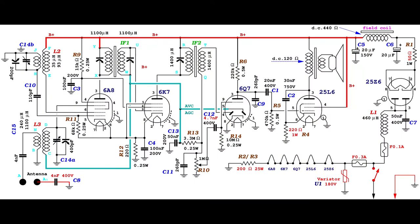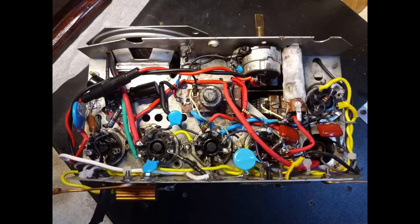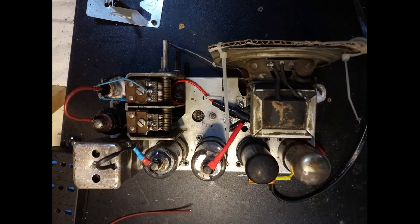In the new schematic, in particular, the following should be noticed. After the power switch, two fuses control the filament line and the B+ line, already before the rectifier tube. The purpose is to put the lowest value possible, to reduce the chance of damages due to overvoltage or to internal short circuits, typically in the filter capacitor.